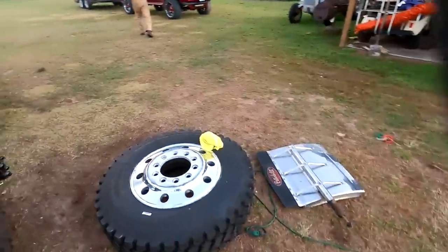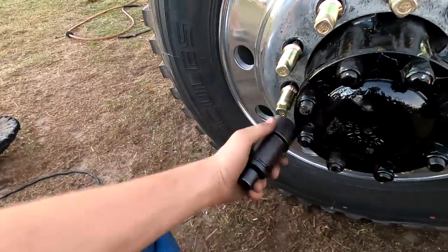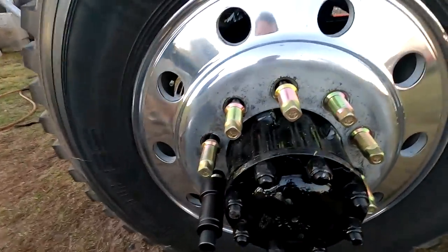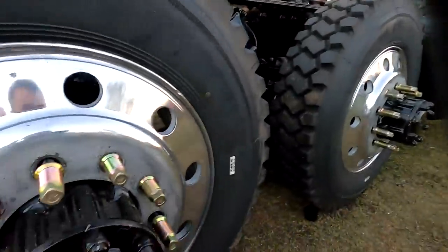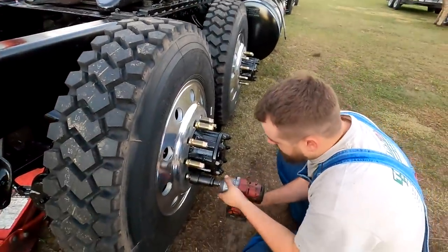We'll take this off. So little brother went to the Snap-on truck for me and spent $300 on this little combo, which is a 1.5-inch socket and also a 13/16 square socket on the inside. So we're gonna run all these down with the breaker bar really tight with a pipe on the end of it. And then we're gonna mount this one wheel up because that's all Iceman got done. Slacking. And we're gonna go from there. Here you go, little brother. Torque them down.